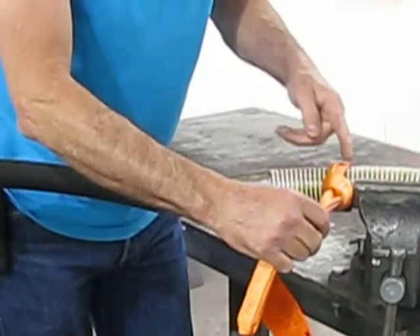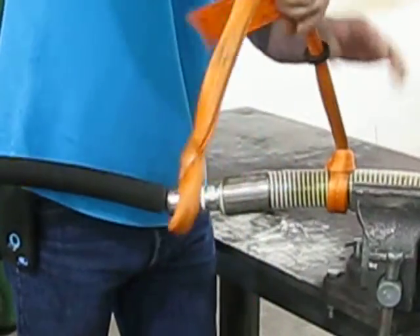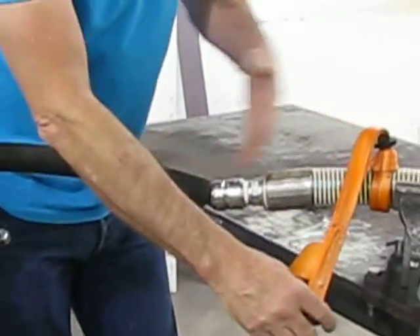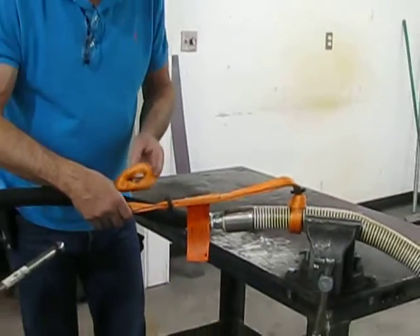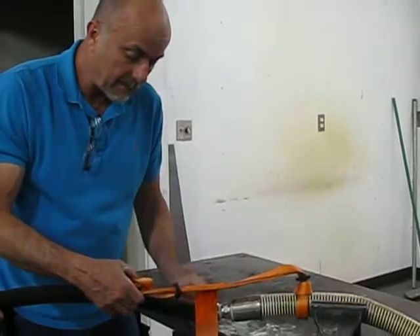Place it right here six to eight inches from this fitting and pull it in like that to where it tightens in on it, then run your snubber down. So again, we still have a connection here and the line is full of fluid. Then you want to come over here on your hard pipe or your other hose if you want, either way. You do not have to break connection.